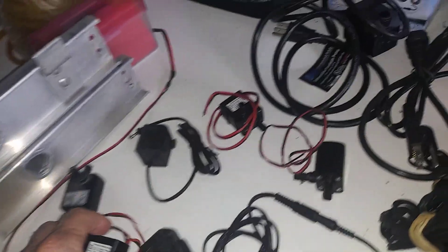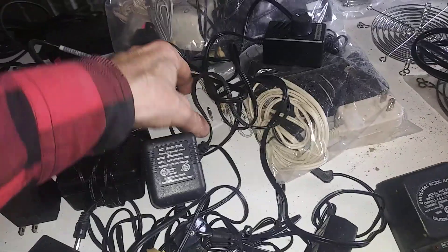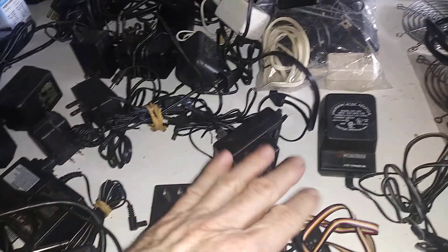These are some of the little water pumps I use. I wanted to go over the power supplies — you can get them in different styles. I've got some 9-volt ones too, so if you wanted to slow down your water you could power it with a 9-volt. If it's only nine or six volts, it'll keep the fan speed low. For the water pump, slowing it down is important — you can use a 9-volt, 6-volt, or 7.5-volt power supply as long as the amps can keep the pump running and the water flow just right so you don't melt all your ice.